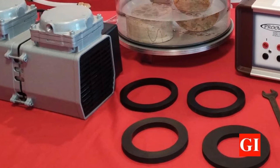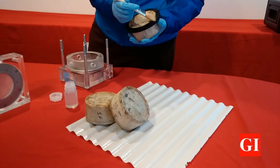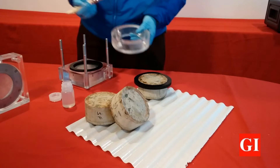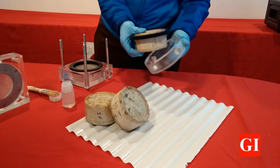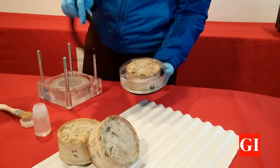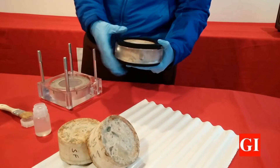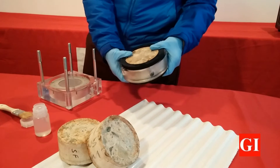Pruvit cells come with 4 different gaskets depending on the size of the sample. Place the appropriate gaskets on the ends of the concrete sample and spread some silicone wherever the gasket is in contact with the acrylic. This will allow the gasket to expand and fully seal the sample. Once both gaskets are on the sample, try to center it by pushing it towards the middle of the sub-assembly. If correctly done, the rubber gasket will extend 1.5 mm past the face of the sample.